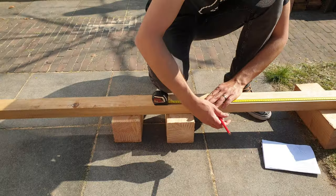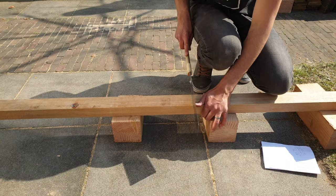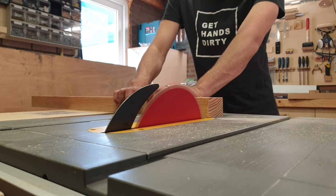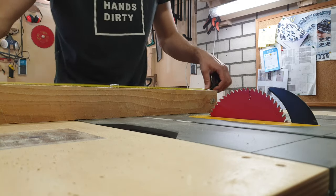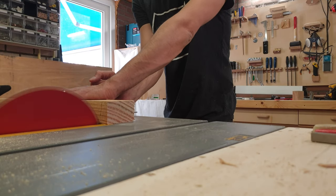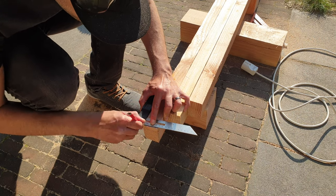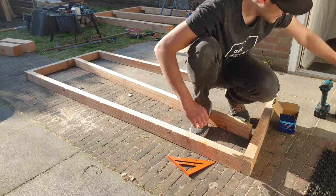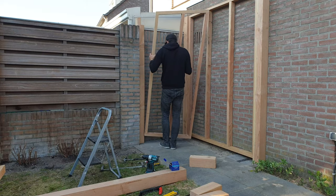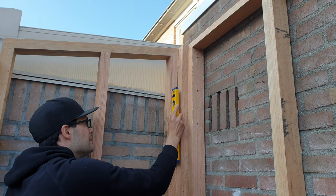Next up are the frames that go in between the front and back posts. To start those I first cut the lower stretcher to size. The vertical pieces all have different heights so I only cut those to rough length. The top piece needs a 9 degree angle on both ends and I cut those on the table saw. The vertical pieces also need a 9 degree angle at the top, and after I cut those I determine the exact length and cut them to size. With the frame assembled I fitted it between the left side first, since this needed to fit exactly between two walls. I lifted up the frame to the correct height with spacers on the bottom and screwed it into place.